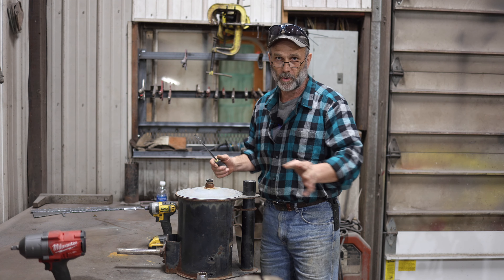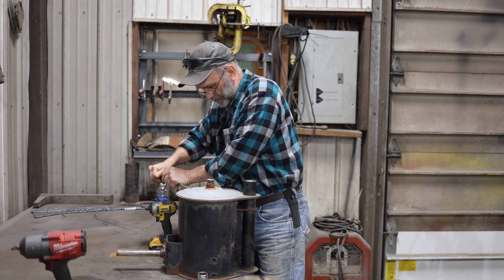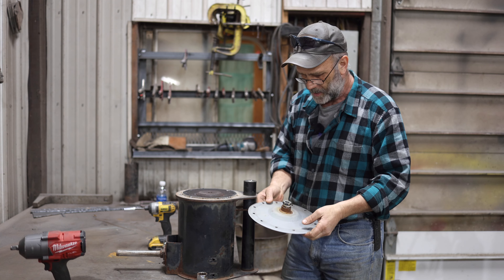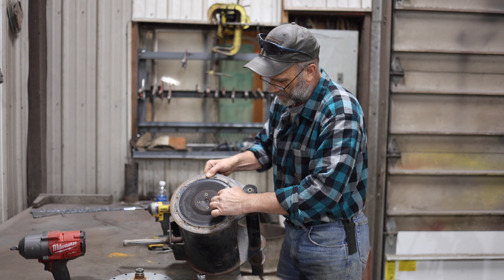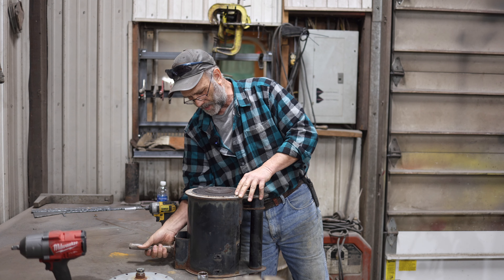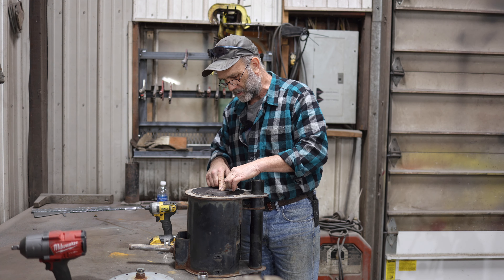Next thing I want to do is take this plate off. These are half-inch bolts — use a half-inch socket, they're 5/16ths. I'll yank these all out. I'm doing this video to benefit the do-it-yourselfers that have the tools and the desire to do these things. It's not that it's that difficult, but you do have to have certain tools, and a torch is going to be really necessary. These lids, once you take the bolts out, are still on tight. You've got to get underneath, because that diaphragm will just kind of glue itself fast. Pop it off — simple as that, it's off.